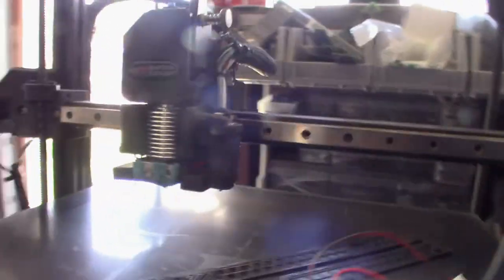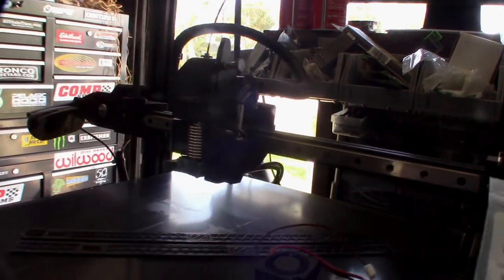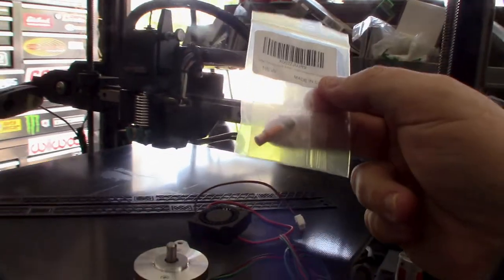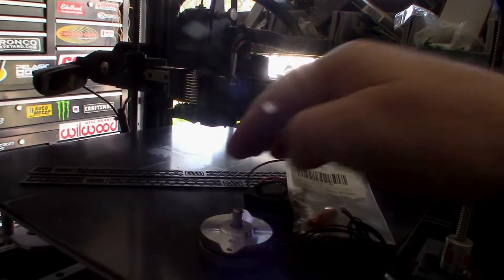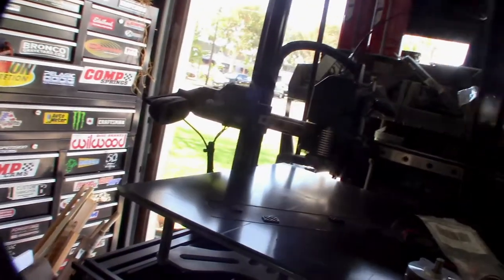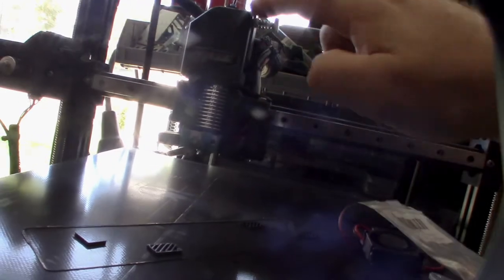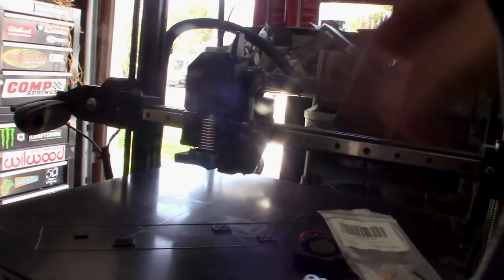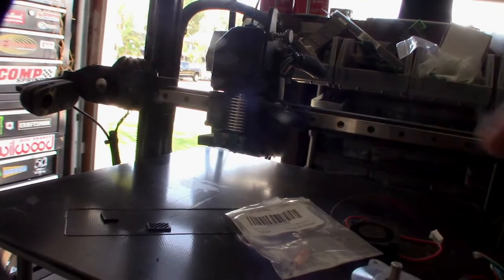This is my first design — the blower fan was actually in the back, and it works fine. In my new design I'm going to make it ultra-light. The whole reason for this video is this heat break right here. I was hoping it could prevent jamming. One of the cool things about my system is that I wanted something that could come out easy in case of a jam — just three screws out and the whole thing's out so I can fix the jam.